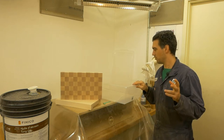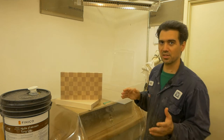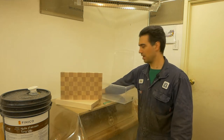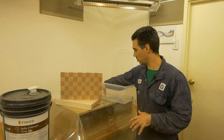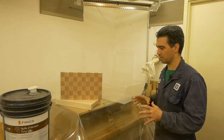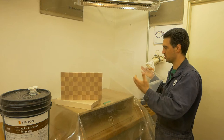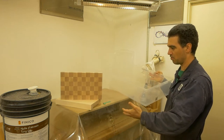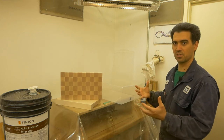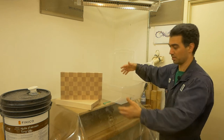The two things I needed to figure out: number one is buoyancy. Wood tends to float to the top of surfaces like water and oil, so I need to find a way to keep it held down, submerged in the oil bath. The other thing I needed to figure out is how to prevent the air pressure around my vacuum from collapsing the vessel. If I insert the vessel into my vacuum bag, all the air pressure once the vacuum is created is going to deform and potentially break it — and if there is oil, it's going to spill everywhere inside my bag.